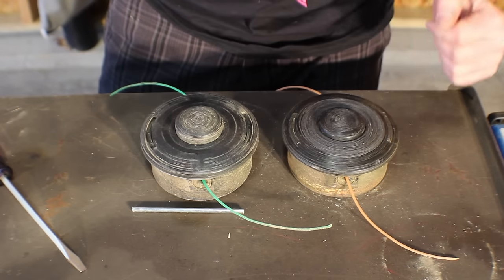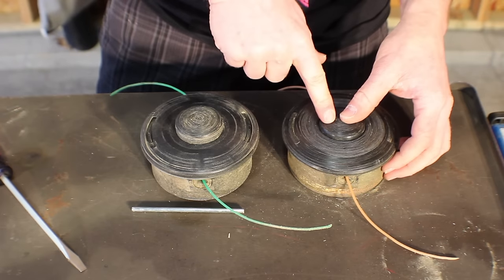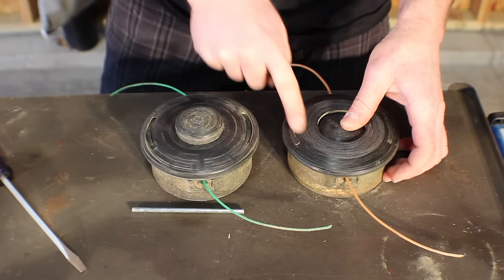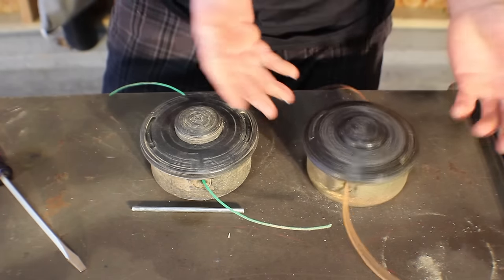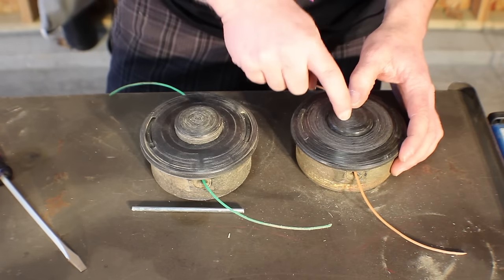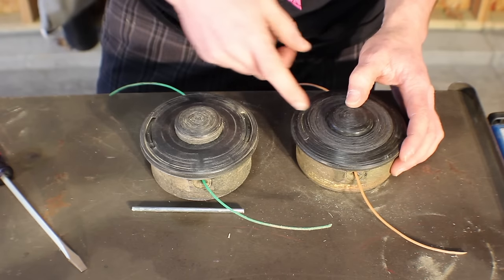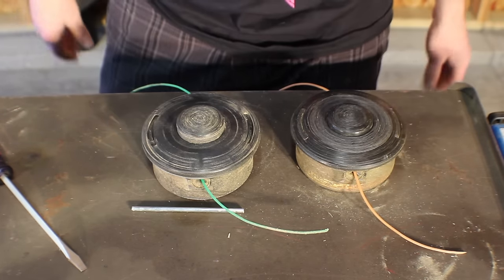As you use your machine and bump the line out, this spool will wear down. As it wears down it'll eventually get to the point where when you bump it, it'll start grinding away at the top plate, wearing it out. If you keep going it'll wear out the tabs on the head itself and you'll just have to pick up a whole new head. So if you start seeing wear up here, go ahead and get a new spool, or else you'll end up having to get a new spool and top plate. The top plate is like $12, so that's 12 bucks you don't need to spend.